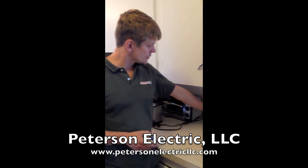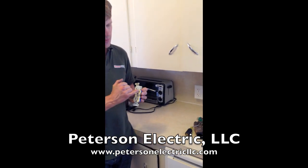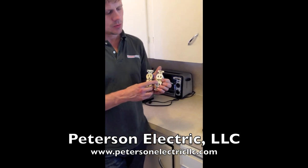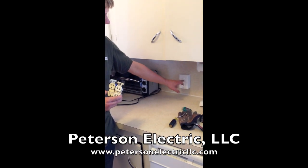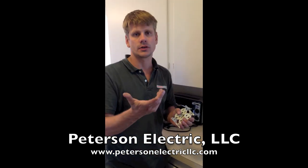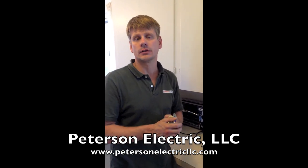But they will allow the GFCIs with the tamper-proof design, so the newer ones have plastic tabs inside of all of the outlets. This is an older-style three-prong and an old-style two-prong, but the newer ones have a TR and there's plastic tabs, and that keeps kids from pushing into a device to get electrocuted, such as maybe a screwdriver or a hairpin.